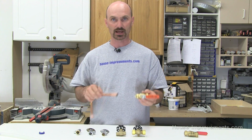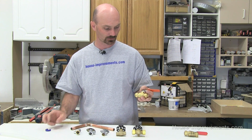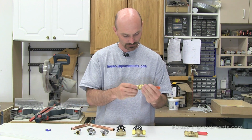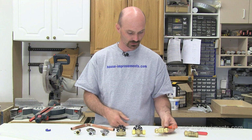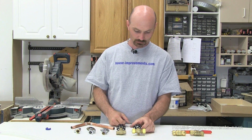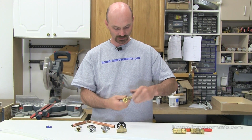And the copper would just slide in there exactly the same way and can be released exactly the same way from the slide-in fitting. Okay, so that's still a ball valve. This one doesn't actually show a direction either, so that's still another type of ball valve. Then we get into more of a gate valve type setup. So this is typically what you see.